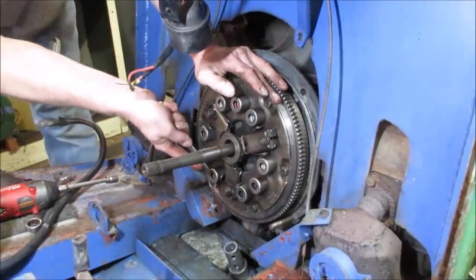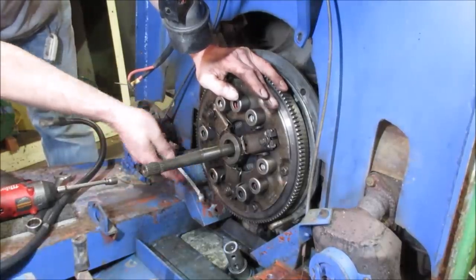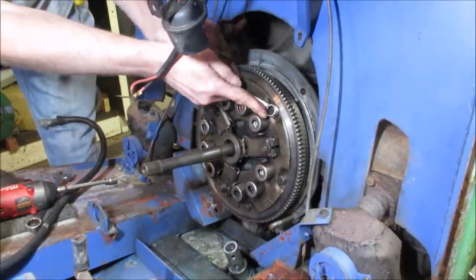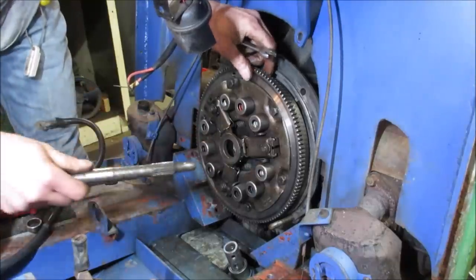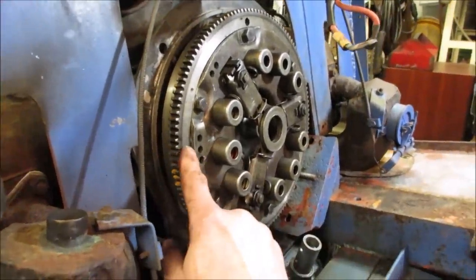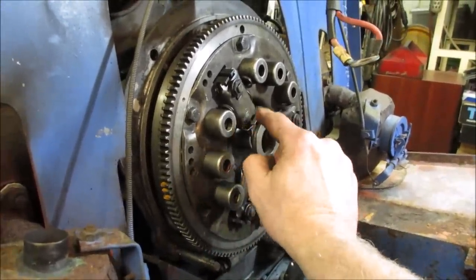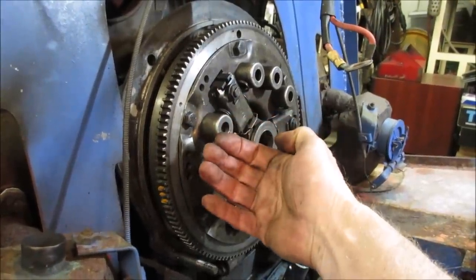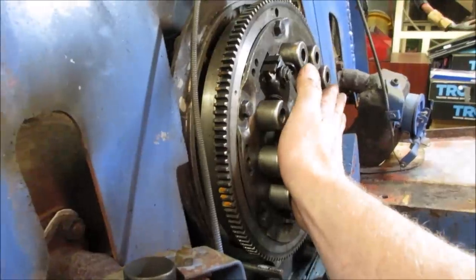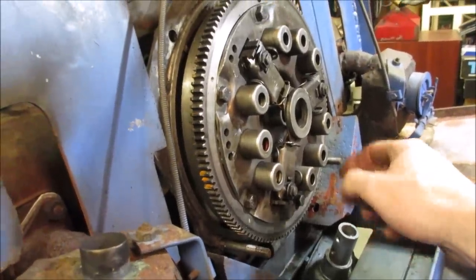I'm just going to go over it with a wrench now, because I want a good hand feel for how tight they are. You'll feel them snug up. When we're done, we can just pull this right out of here and everything's aligned. I know I'm beating a dead horse for some of you, but some people have just never seen it before. Now it's all sandwiched together. Power from the engine would go right into the transmission powering the wheels if it's in gear. If you push on this surface, these hyperextend that side of the pressure plate and it comes away from the disc, so the disc would be able to spin within there. The thrust ring here - if it's level with the back it's fine; if it's on an angle, you've got a clutch problem somewhere. It looks pretty decent.